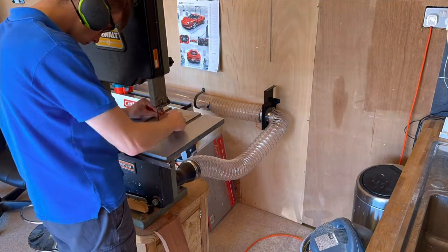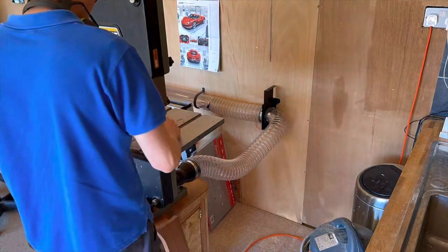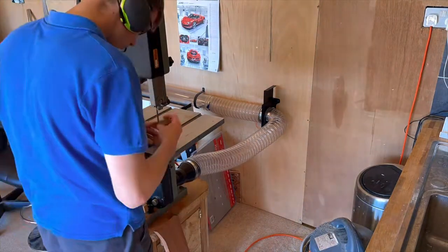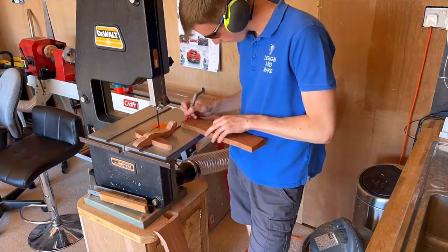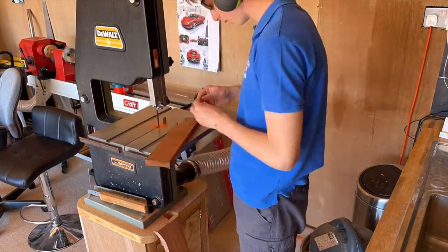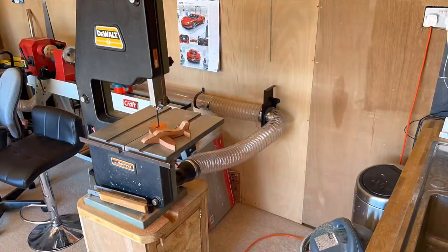The sapele I used for the wings was 19 millimeters thick, which is a little bit thick to be cutting on the bandsaw with a 3/8 inch blade, but I made do and just took my time. The shapes were quite intricate so I had to do quite a lot of small cuts, but I took my time and eventually got the shape cut out. On the same piece of sapele I then cut out the tail wing section — I only cut one out and then cut it in half so that it was as symmetrical as possible.